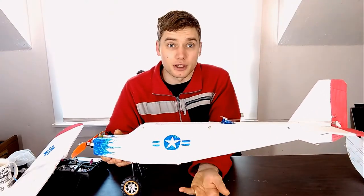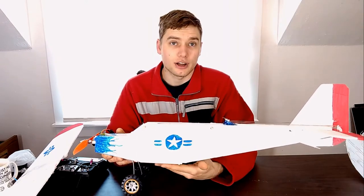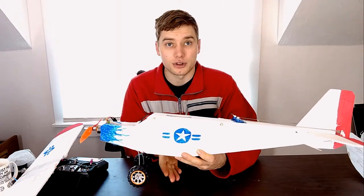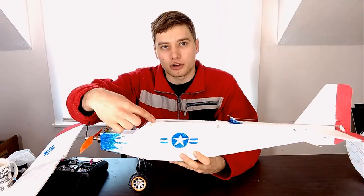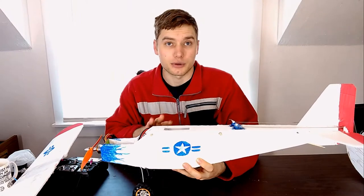It's obviously based on a cargo cub or a regular Simple Cub, so I shortened it up. I made this section flat to mount my landing gear to, so I could glue the landing gear directly to the bottom of the plane. It also allows me to take measurements from the top of the plane down to the bottom when I'm building it, so that I get everything symmetrical.